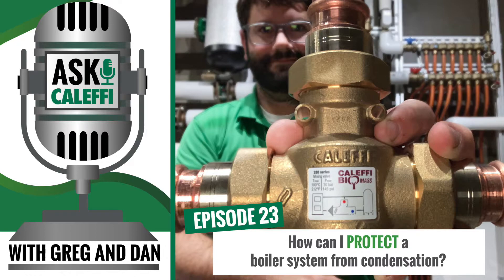Obviously you're not going to see them much at all — you shouldn't see them at all on any of your modulating condensing boilers. But there are a lot of mid-efficient boilers out there that are still continuing to be installed, and there are certainly applications for them: anything that's a copper fin tube, cast iron, whether it's fired off of oil, natural gas, LP, or even wood boilers.